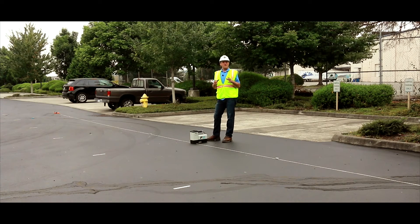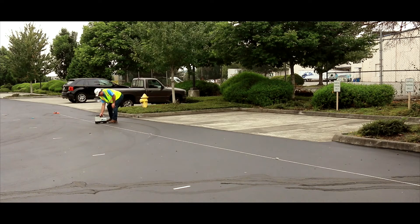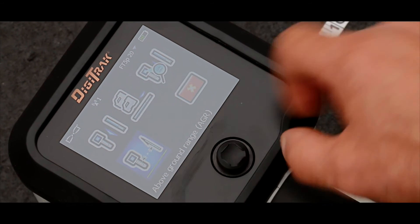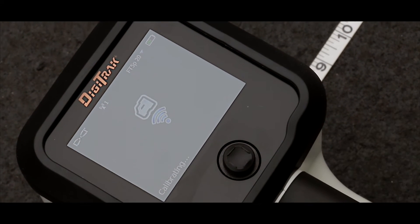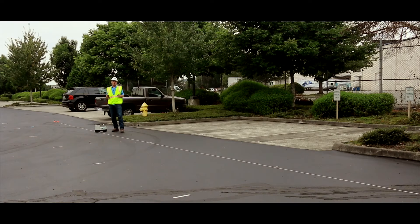Had I needed to prove my calibration to distances beyond 30 foot, that is where we employ the 50-foot calibration menu. I'm going to go to the 50-foot calibration menu option, which is a subset of the calibration screen — above ground range. One thing I need to point out: conducting this 50-foot calibration has absolutely zero effect on the readings we will see later in the day when we go underground. This has nothing to do with our real depth. All it has to do with is showing that you've got a good, clean calibration at distances greater than 30 foot.